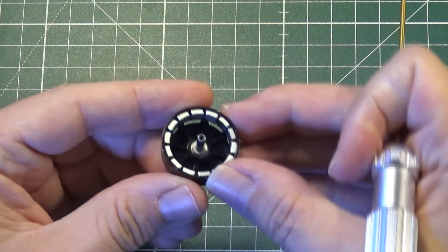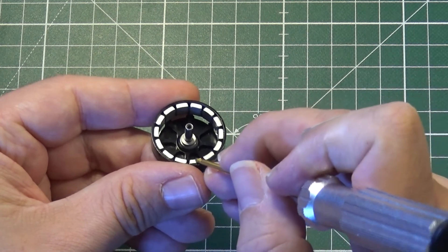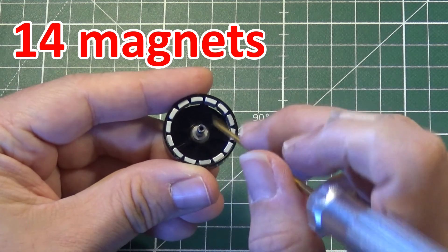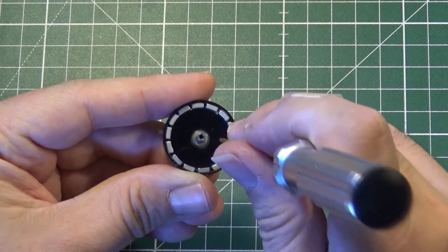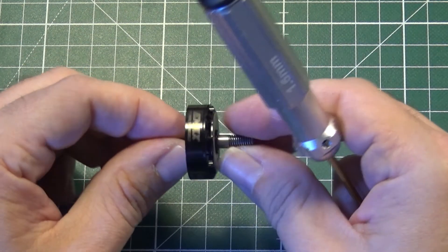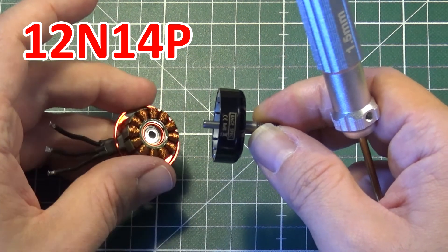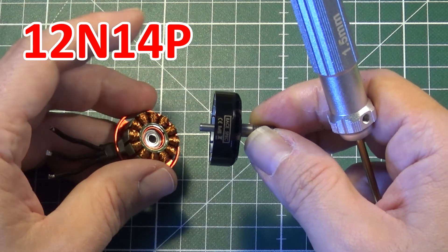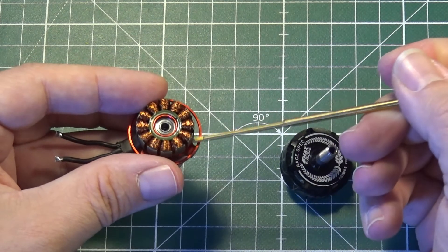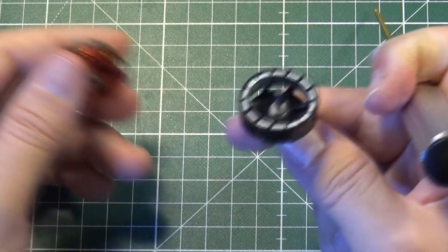If we look at the bell and count the magnets, you will see that there are always 14 magnets — not 12, not 16, but 14 magnets. The motors we use in our hobby, the brushless OutRunner motors, are called 12N14P, meaning there are 12 coils and 14 magnets.